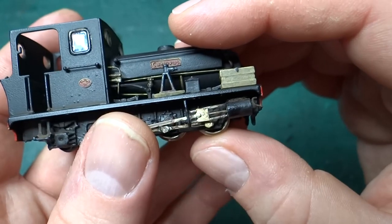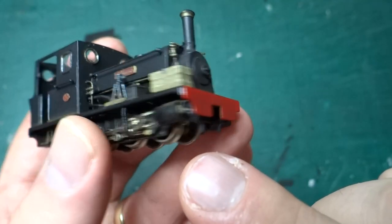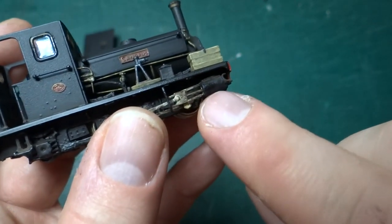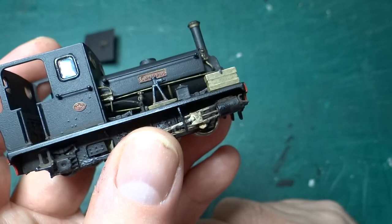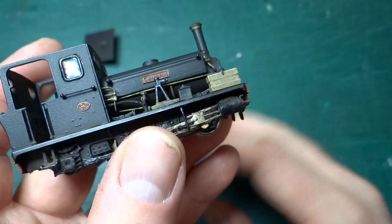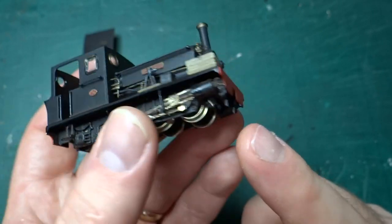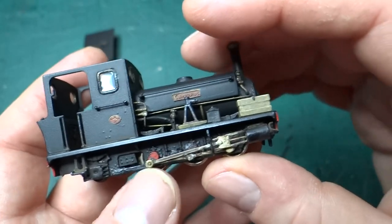I also replaced the cylinders. On the original kit these were white metal castings. They didn't have a hole down the middle for the pin to slide up and down, and try as I might I could not drill that out sensibly — I broke a couple of drill bits and couldn't get them centred or straight no matter what I did. So in the end I used my lathe to turn a replacement set. These are brass cylinders I turned on the lathe with some detail added to the end to match.